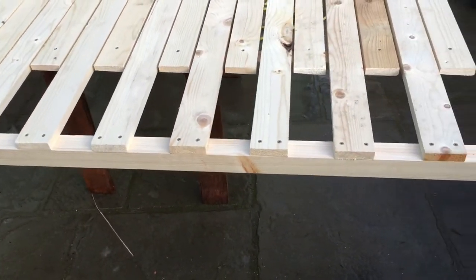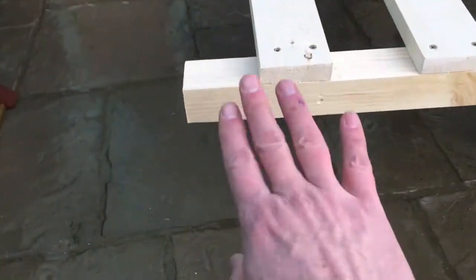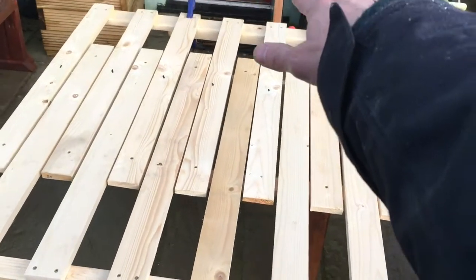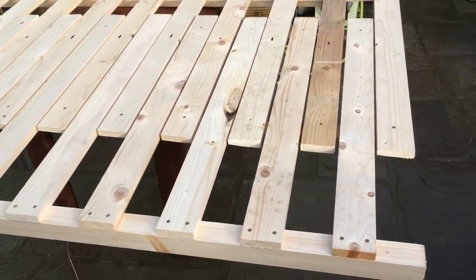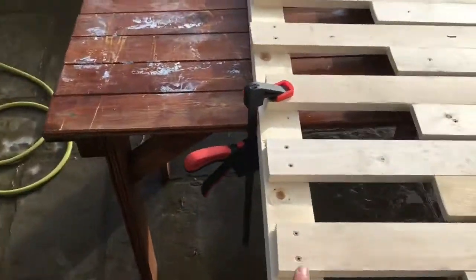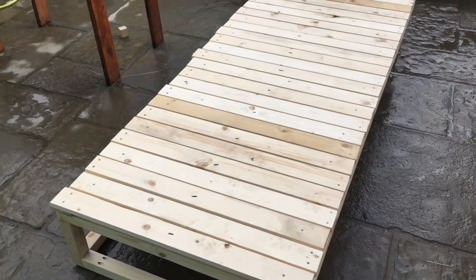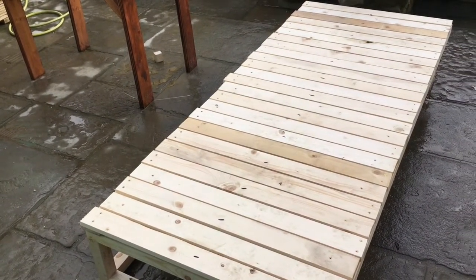This will eventually have legs on it. I'm not putting them on yet because I've got castors on just so the bed can be moved around and then I'll know the exact length. The legs that you fix on here should be about 5mm shorter than the height of the bed, because you really need to tip down the moving part so it rides up over the back. My next plan is to move these into the bedroom. This will be hinged onto the base unit so the whole thing can lift up. The moving unit is now temporarily fixed onto the base with a couple of screws — I'm going to fix hinges but I'll assemble it in situ because it's too heavy to carry up the stairs on my own.